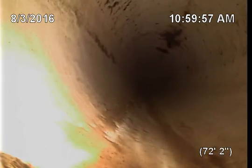So we don't need to do a full line replacement. We would need to do a repair out there. It's 4 feet deep, 3 feet 8 inches, but we got to do the 4, and 12 feet long. That would get that part open. The other part, the worst part, is back here. It's going to be back around 10 feet. So we got a little ways to go. And here's your feet and distance that he keeps talking about.